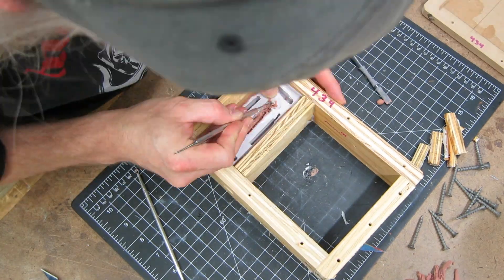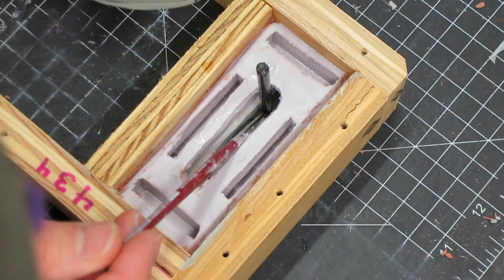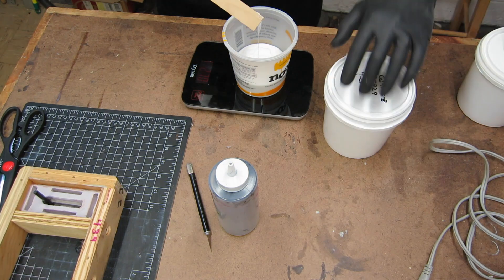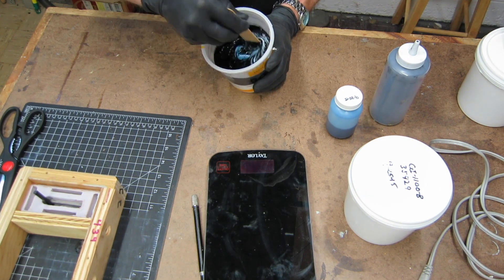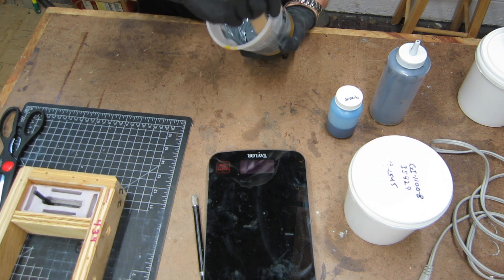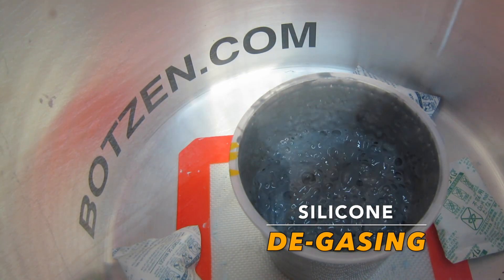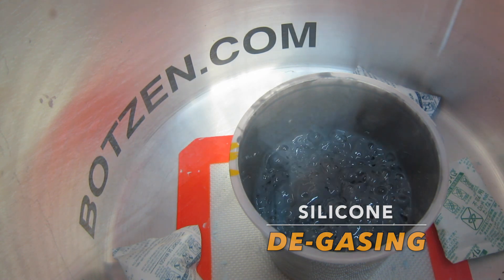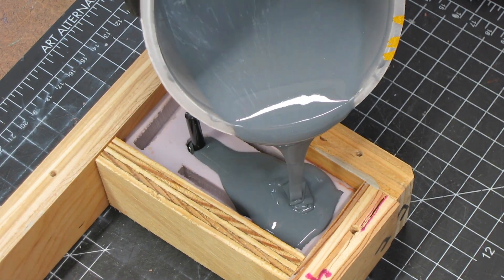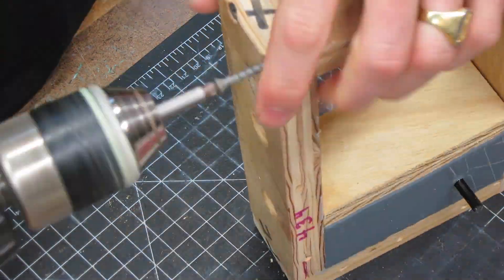After the silicone is set up, I remove the bottom — I remove the little fake floor. It gives me some space. I want to keep the part in the silicone so that I can pour the other part B on top. I add a little bit of release agent because it's silicone against silicone. I'm mixing up the silicone for the other half of the mold and I add a little colorant to it, some toner, just to differentiate the two silicone halves so they're not exactly the same. I degass the silicone as well, and then I'm going to pour it on top — first inside the part and then to make the rest of the mold. The little stick sticking up there is going to be my pour hole when I pour the resin into the part.